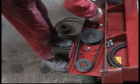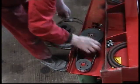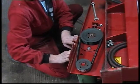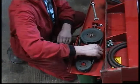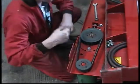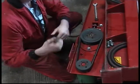V-belt tension is set using the adjuster. See pages 10 and 11 of the operator's manual. Whilst setting the tension, one must rotate the conveyor belt, thus allowing the correct tension to be achieved of 10 to 15 millimeters. Important: too much tension will increase motor wear and result in loss of power on the conveyor.